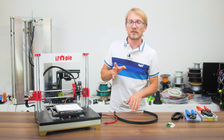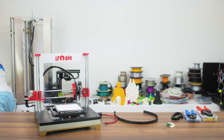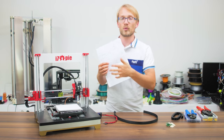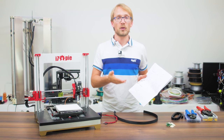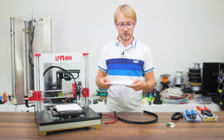One last tip: make wiring plans and label your cables. It's super easy to do — just write down which wires and cables you're using for what functionality. Since they're color-coded, you know exactly where to look. Even the simplest plans can help you out a ton if you ever want to modify anything or have to troubleshoot an issue down the road.